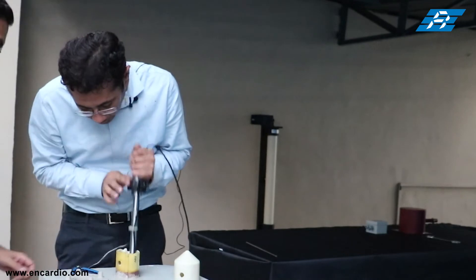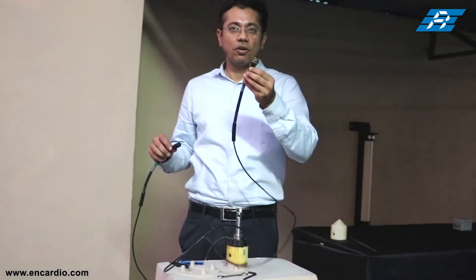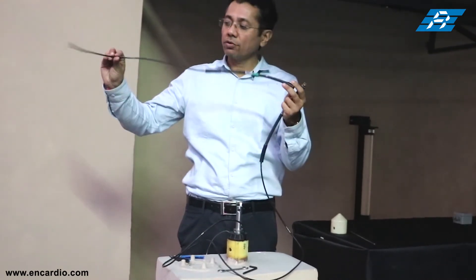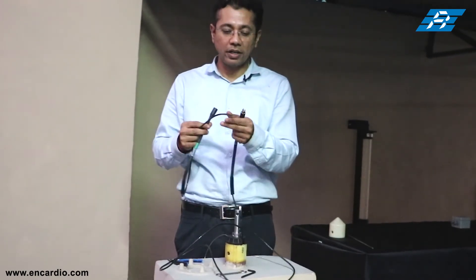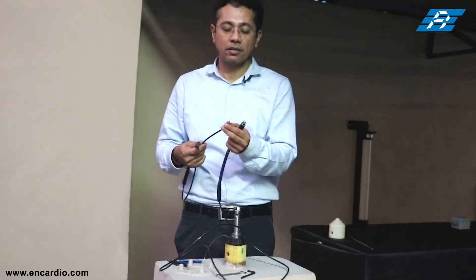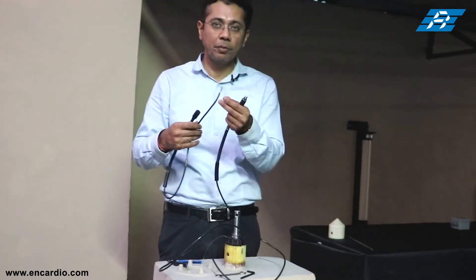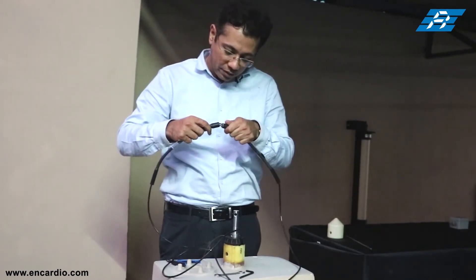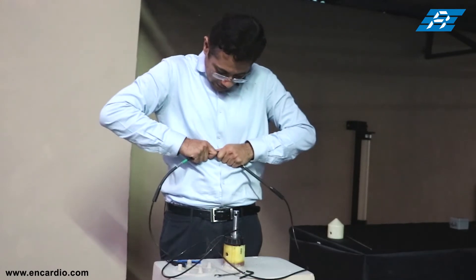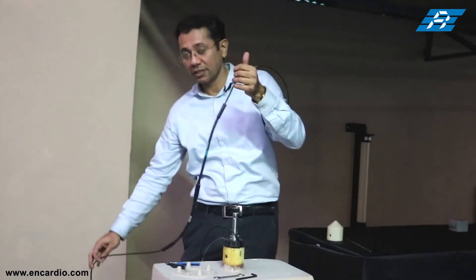You can now lower it — as you can see, only one cable has come out of the whole assembly. The male seacon connector of the whole assembly will be connected to the top connecting cable. This top connecting cable has a female seacon connector on one end and three wires on the other end, as it is based on SDI-12 technology. These three wires will be connected to the junction box.